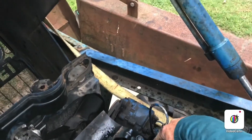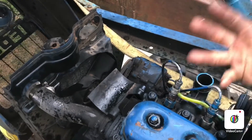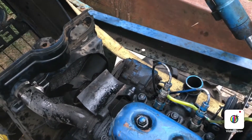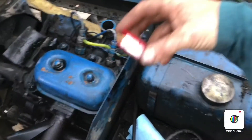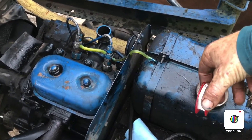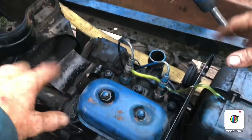An important thing I did — I noticed that bubbles were coming up out from each injector as it was trying to start. Never read anything about this or nobody ever told me, but I went ahead and put some Teflon tape around the threads. And it's actually dry here now — it was all wet around there before. All kinds of things could have been causing this problem, just as old as this motor was.